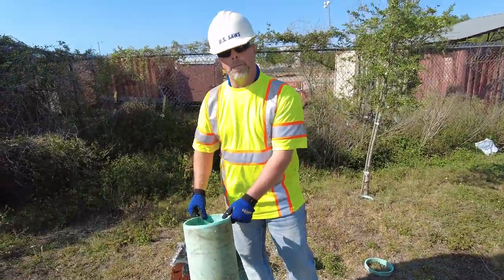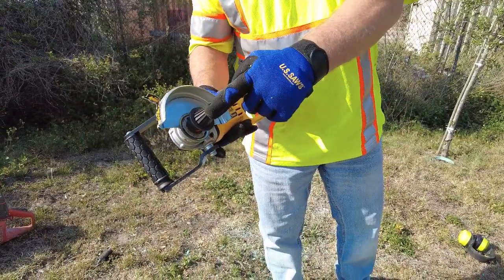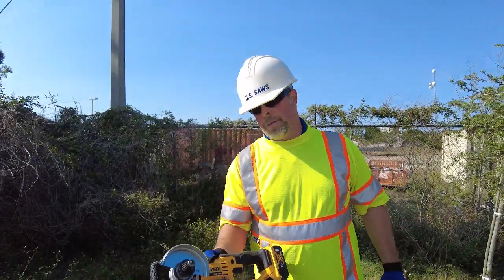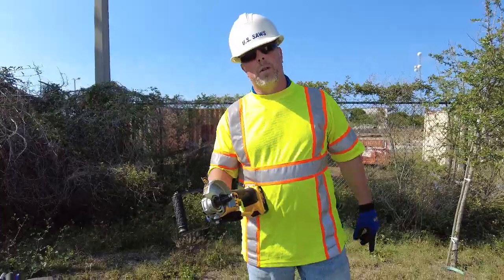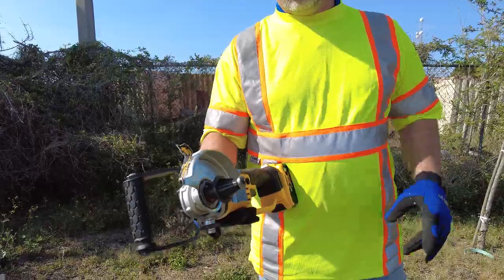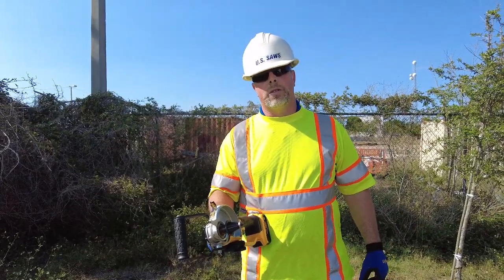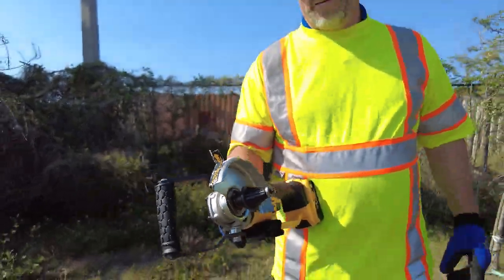This is a small battery-powered tool with a universal beveler on it, designed to bevel just like the big saw does but in a small handheld package. It has a 16-flute, since the 16-flute is designed for low-horsepower tools. This is the economy version with a basic thread-on design for all 5/8-11 shafts, so it threads right onto the shaft of the grinder.